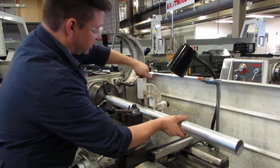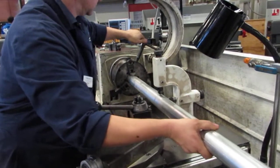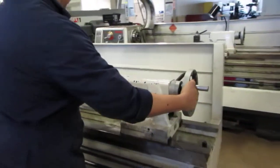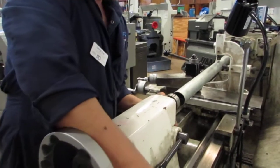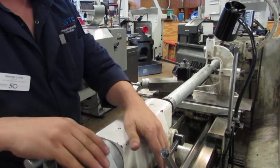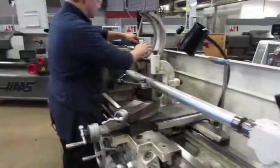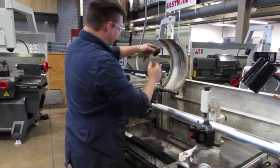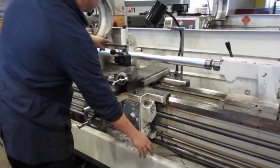If I'm too close, I'm just going to back these out. I'm going to snug that up without tightening it and apply my tailstock. I'm going to let it draw it into position, and I've got a little bit of tension on it. I'm going to lock my tailstock down tight. I'm just going to put a little bit of pressure on it. I've already set my RPM pretty low so that I can get started and I'll adjust my follower.